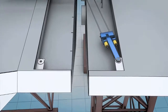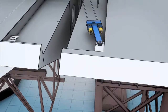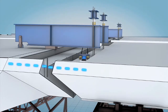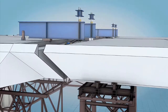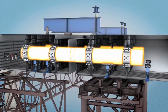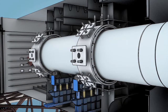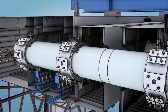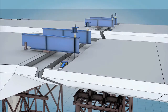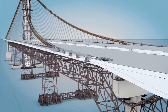Now the bridge has stopped moving at this point, so we're also working on lining up the different decks. This is the Skyway portion of the bridge; this is the SAS. There are jacks out there right now — we're exaggerating how perfect this will be — but we have to get this connected in such a way that you don't feel a bump when you go across these different bridges. One of the innovations on this bridge is the hinge pipe beams that protect us in an earthquake. They will be slid from the Skyway into the self-anchored suspension bridge, locked down on the SAS side, and they can move on the Skyway side. We have a fuse in the middle of them that can bend and contort in a massive earthquake, and then a steel accordion plate goes in that area to allow traffic to go across.